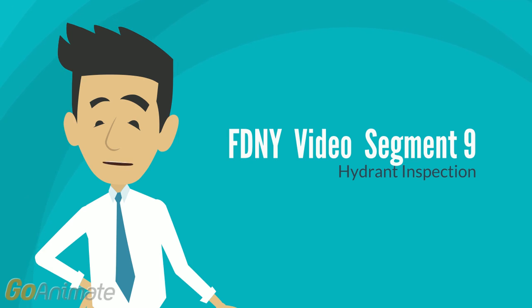C. Open the hydrant to fully open — it will come to a solid stopping point. Do not try to open the hydrant past this point, as damage can be done to the internal parts of the hydrant. If the hydrant is not fully open, water will flow out of drain or weep holes and cause damage to the drain field around the hydrant.